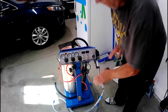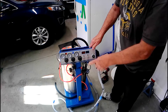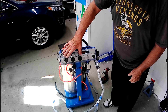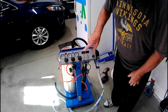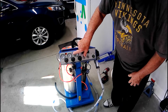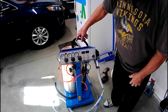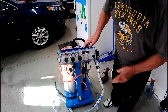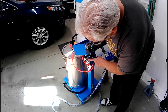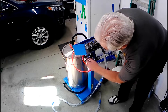For the red hoses there are absolutely no instructions on where any of that goes, so you get on YouTube, but those videos basically don't talk through it either. What you want to do initially is figure out what everything does, and from there you can figure out where all the plumbing goes. There's a little arrowhead icon meaning the gun, a white cloud meaning air going into the gun, and a black cloud meaning air going into the powder coat. I have to add a gauge for this regulator — set at about 50 PSI.